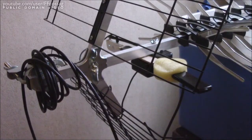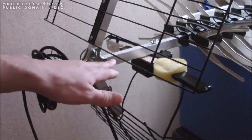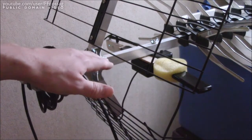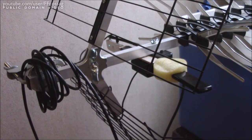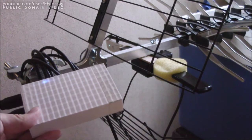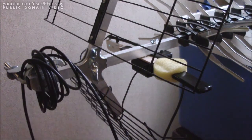So with that in mind, as for doing the actual 4G conversion, I just chose the simplest route. Rather than trying to convert the original receiver bit which went there, I've just chosen to remove the original receiver and mount my 4G modem on a piece of plywood where the original antenna went. Connection to the modem is just made by a USB cord going to this TP-Link TL-MR13U wireless router, which takes care of converting the 4G into a normal wireless network.